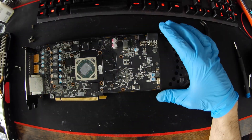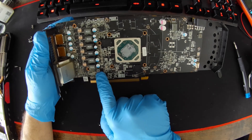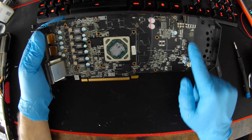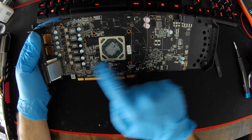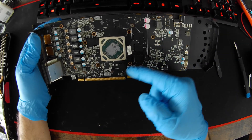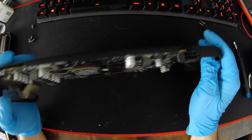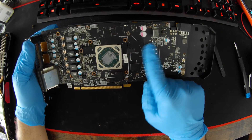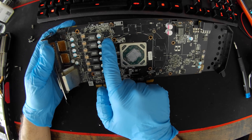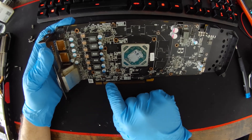Now the actual PCB: memory chips, GPU core, and the VRM memory. The display port is here. This is the main voltage regulator — I would guess this is 5 volts, and 12 volts here. This card exists in a 580 variant, so there's supposed to be a secondary 8-pin connector there, but since this is just a humble RX 570, there's just a single 8-pin connector. This should be memory, and if I'm not mistaken, that's the main PWM IC logic chip.